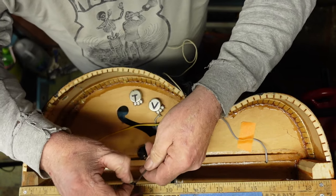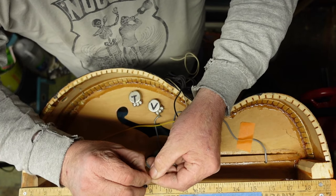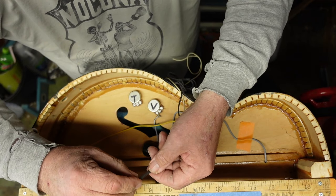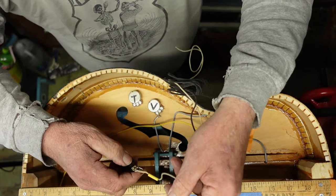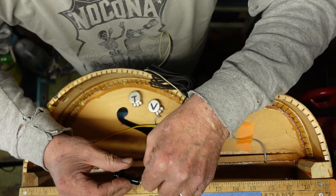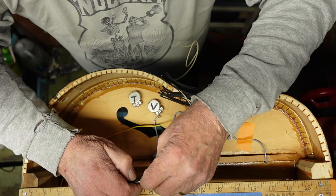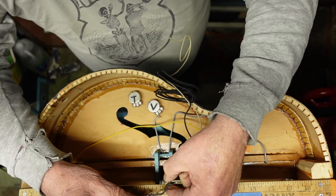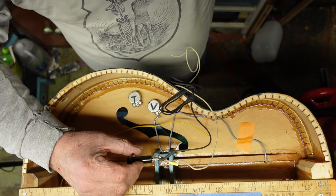And then I put my ground wire on the pushback wire, like this, and kink that there, and kink this here. But you'll see that there's not too much space between where these two wires are going to touch. They could possibly touch. And I always use shrink wrap once I make those soldered connections. You see that? There. It helps if they're within the frame of the camera, correct?